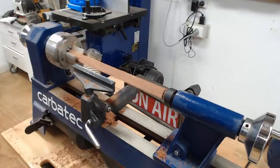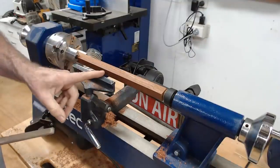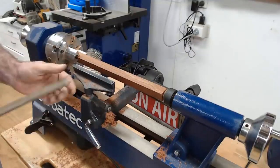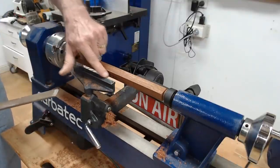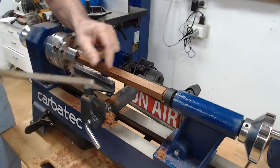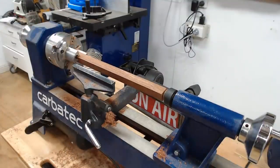It's nice and quiet, this lathe. I love it. One of the other things I found when I got this, just this morning, I got a file, because yesterday when I was practicing a little bit, because heaven forbid I should do something without actually having a practice before I start the show, the gouges were catching on the top here. So I got a file and just slowly dressed off the top so that there were no little divots along there for the tools that I was using to catch. And when I had done that, I decided to do a little bit down the back as well, so I didn't have a very sharp edge to cut me. All right, just a little tip if you're interested and if you'd found something like that had been happening.